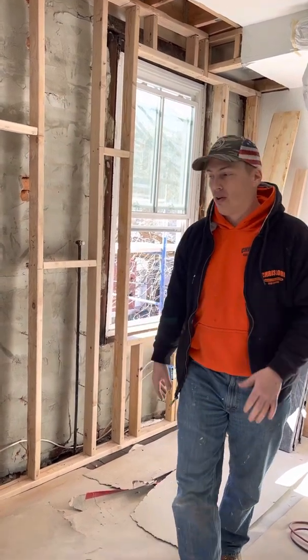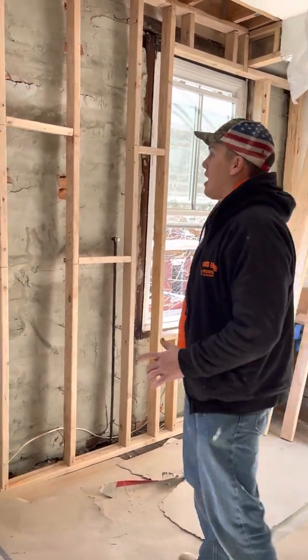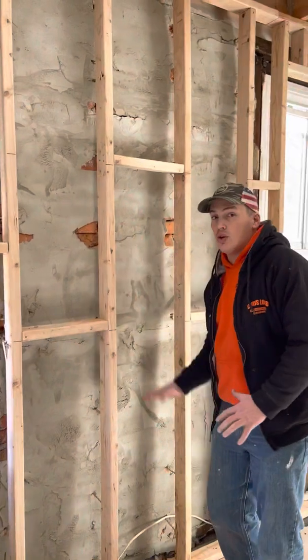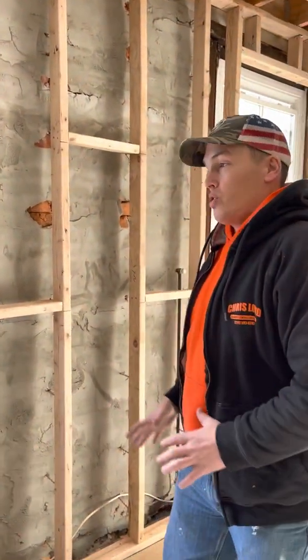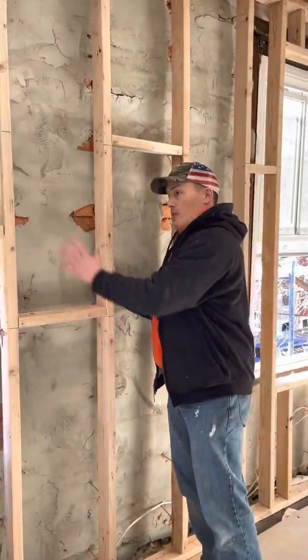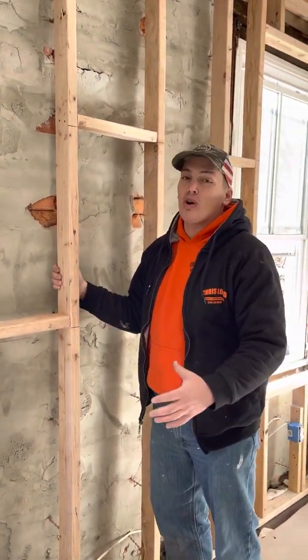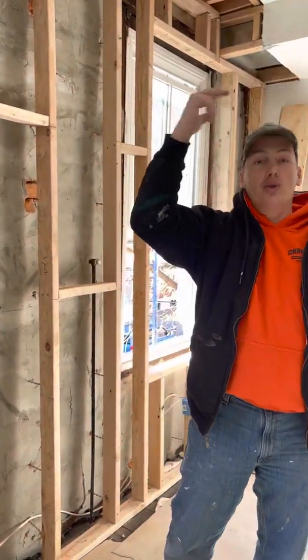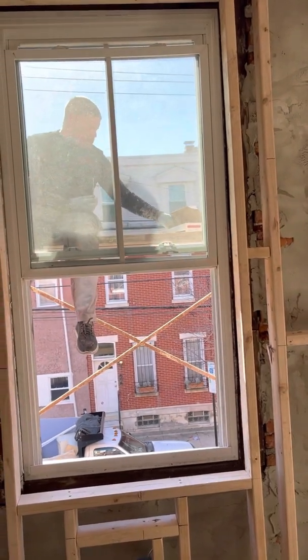We're doing helical ties here because the bow isn't in line with the joists — the joists are at the floor and ceiling. You could still do stars but you'd have to add a post or framing to bolt to, and it's not as strong because you're not going through three or four joists, so it won't give you as much support.